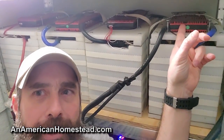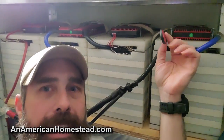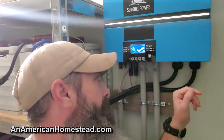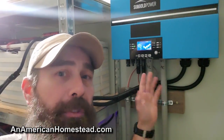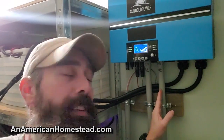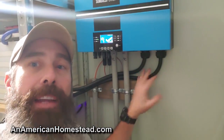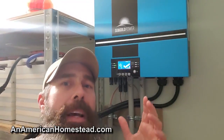Our friend Roy came over and we paid him — he designed and created these batteries on his own. These are lithium iron batteries and they are performing absolutely fantastic. They have the BMS — battery management systems — on each one, which includes thermostats and wireless control. There's a little wireless antenna right here for each battery and each BMS that allows me to use my phone to check the status and health of each battery at any given point. The bank down here is 48 volt, here 48 volt — the whole system together is a 48 volt system. The solar panels come in here, we have AC in for my generator outside in case of cloudy weather, AC goes out to the house, and the battery bank lines connect here as well.